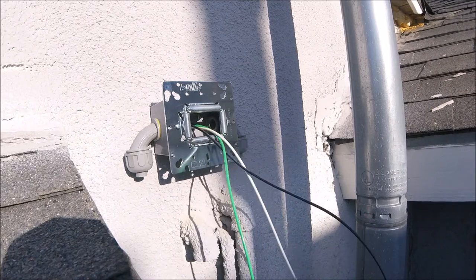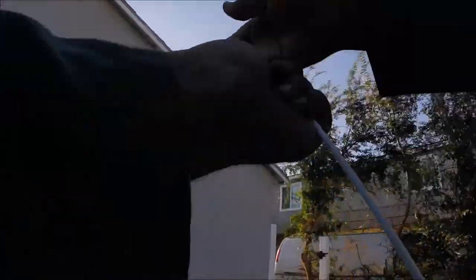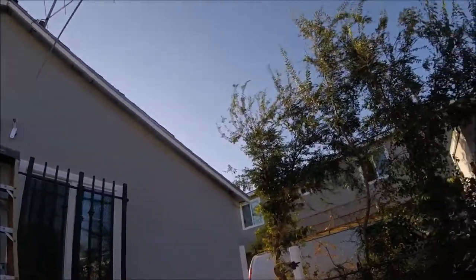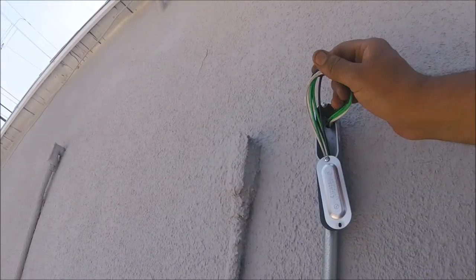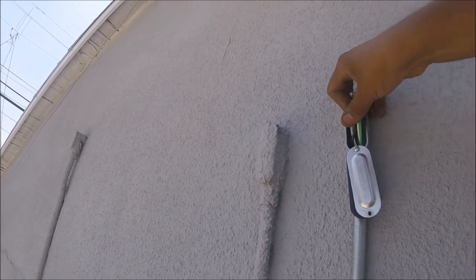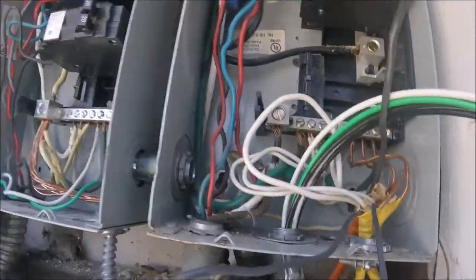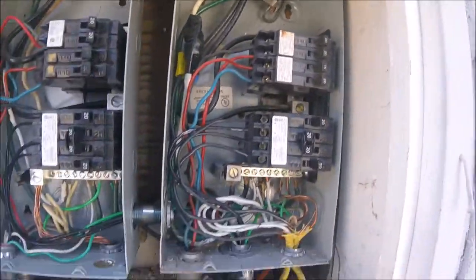As you can see, pulling the wire with this little contraption is so easy. I highly recommend it — and they're not sponsoring me. Zero damage to the wires. Quick tip for the new guys: don't ever put wire nuts in here, it's just a junction box for pulling wire. Right here I'm showing you where the conduit goes into one panel — since there are two separate panels, I put a nipple there so I can run the wires from the other circuit through that nipple, and they all go through one conduit. It just made more sense.